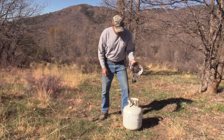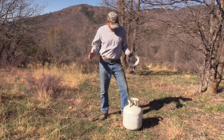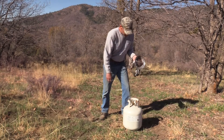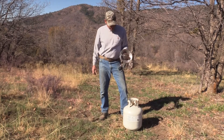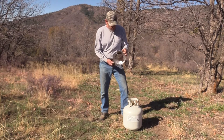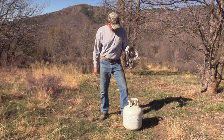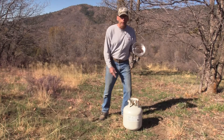to the internal thread on the bottle. The multiple burners will actually clamp to the lip of the tank, and then there will be a hose that connects. They're incredibly efficient and throw a lot of heat. The BTU rating I'm not quite sure on these, but typically at 100,000 BTU, consumption is one gallon an hour on your propane.